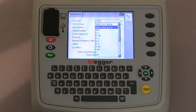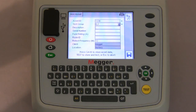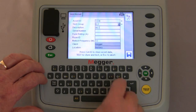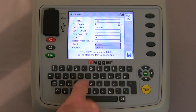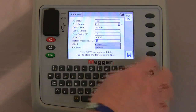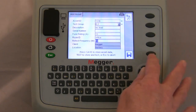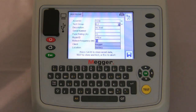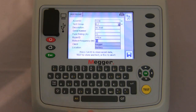In this instance we're going to test an extension lead, a class 1 extension lead. So we scroll down to EL1 and press the select key. Using the navigation keys again we move down and type in the description, serial number if applicable, the fuse rating, and the room that the piece of equipment is in. Moving down we have the retest frequency on the asset and we can see we're in the client and location of MEGA and the factory. At this point you can press the hot key to save the asset to memory, or press the test button to save it and commence testing. If you have duplicate pieces of equipment, you can press the hot key to bring the information back up on the next asset and simply change the asset identification and any descriptions.